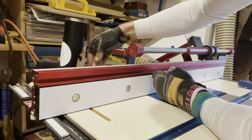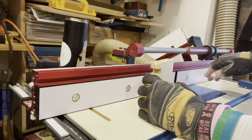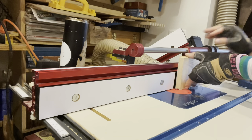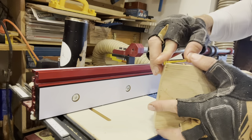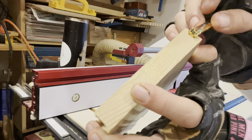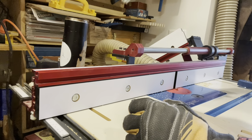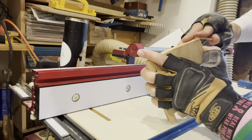I'm going to check on my cheater piece that we're going to have the appropriate depth. The reason why you can eyeball it is because you actually only have to go that blade distance into the piece. I'll kick on dust collection. I'm going to put that in there and check it — I think I actually need to go one more. What we're looking for is that this piece doesn't touch. I don't like the clearance on that because once I spray a little lacquer in there, it's going to build up. I found that to be an issue over time, so I'm just going to take a half revolution and fine-tune that up by about 2/32nd.